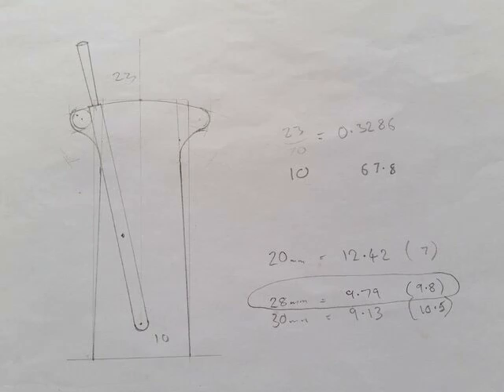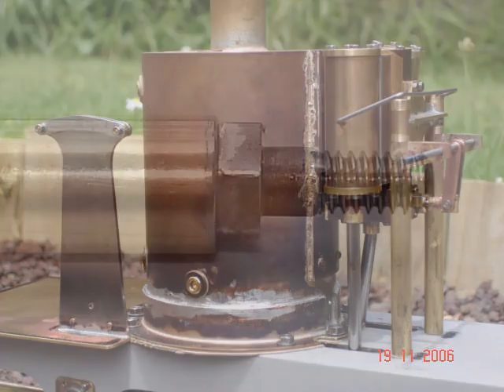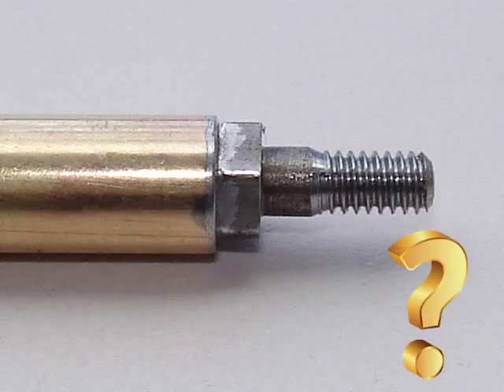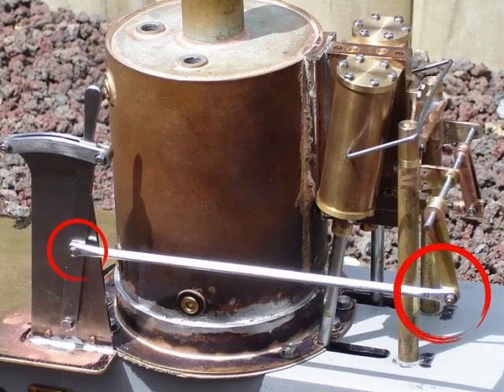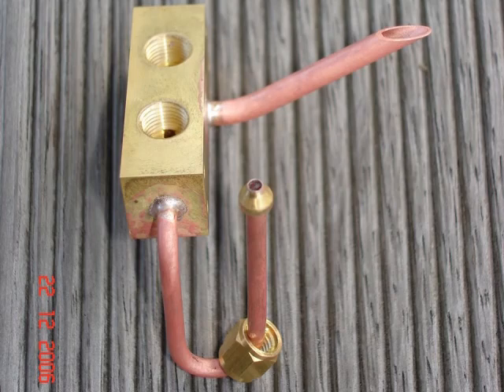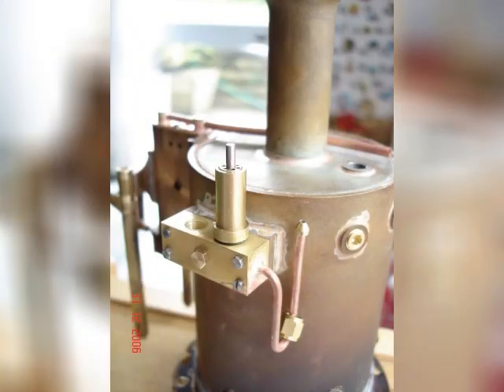Here's the reverser sketch — it needed careful working out to get the throw just right. Reverser stand in place on the newly cut-out footplate, made from 1.2mm brass sheet. An insulating gasket has been made from card to keep the direct boiler heat from the frames, and each holding-down screw has an insulation washer also. It looks like I've shortened a bolt and extended its thread by soldering it to a mandrel — it shows the holding power of soft solder. I forged the reverser rod, heating and hammering the ends on round steel rod to make good pivot eyes. This is the safety valve manifold with pressure gauge tube incorporated, bolting up to the copper pad on the side of the boiler. The angled tube takes steam from the top of the boiler at the central flue. Fitted to the boiler with one safety valve mounted.